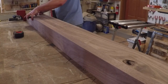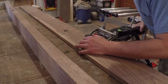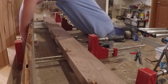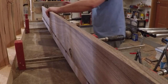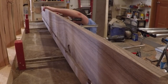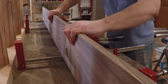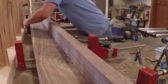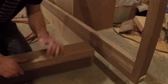I laid out for some dominoes to attach the top to the skirt board, then glued and clamped it all together. It took a bit to get the first few dominoes lined up, but once it was together the dominoes kept everything lined up while I got it in the clamps. Once the glue was dry I sanded off the squeeze-out and did a little test fit to be sure the skirt board would pull tight to the headboard using the hardware.